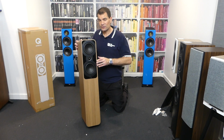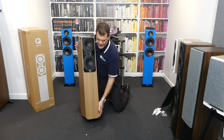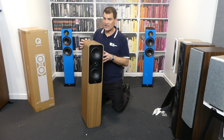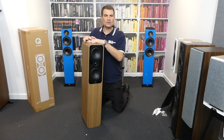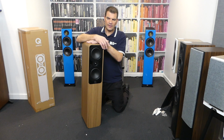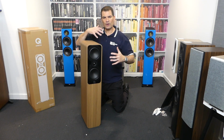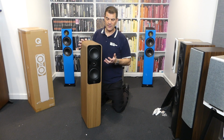And the speakers themselves, and this is what this video will never allude to, are brilliantly well made. They've got a really heavy cabinet. They're about 18 kilos each, which is a significant implication of what work they've done to ensure the cabinets are absolutely perfect. On that note, they're using new point-to-point bracing elements and using computer-aided design, looking at how those bracing elements influence air management, pressure, and other things inside the cabinet.